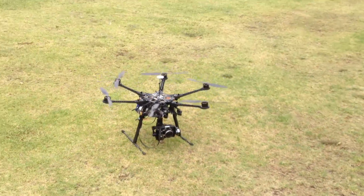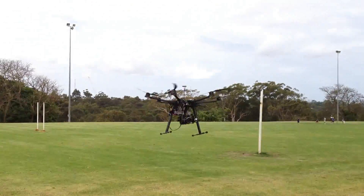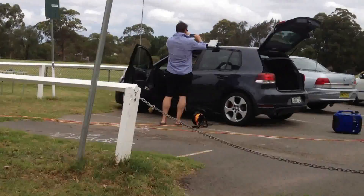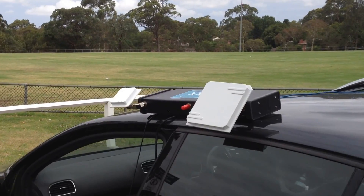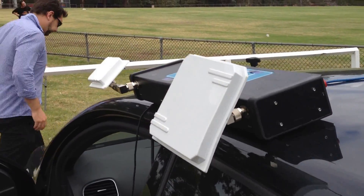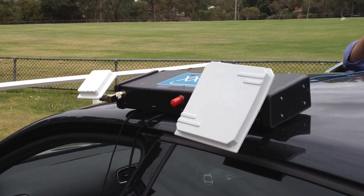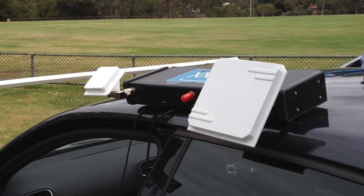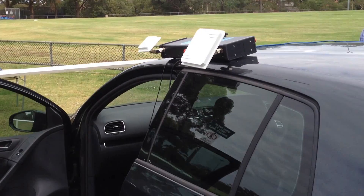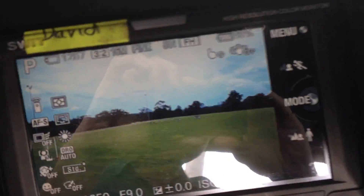We're in a park just in Sydney, just west of the CBD — there goes the aircraft. Over this way we can see we've got the receiver set up here. We're not doing anything particularly special, this is just really rough and ready. The antennas are sitting on top of the receiver. Ideally you want to put one of these a bit further away on a bit of coax to get some good diversity, but I like to test like this because if it works like this then you can only get better when you set it up properly. We're not very high off the ground; you can see the receiver on top of the car. We'll just film the screen for a few minutes so you can see how we go with the picture quality.